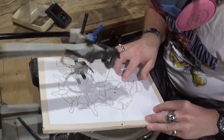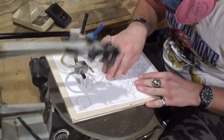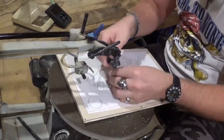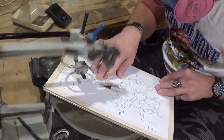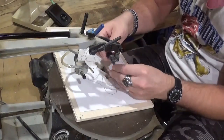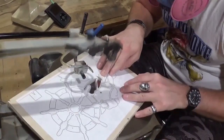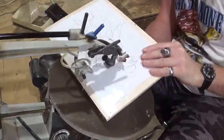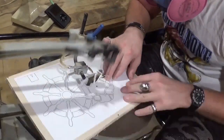Then we're going to head over to the scroll saw and start scrolling. The footage is sped up for time purposes — all the scrolling portions of this video are at five times normal speed. I am using number five reverse tooth shark tooth scroll saw blades, and even though I am stack cutting two quarter inch sheets — which equals half an inch of total thickness — the blade is still cutting through the wood like butter. I'm starting up at the sailor's head and working my way down; you can start anywhere you're comfortable with.